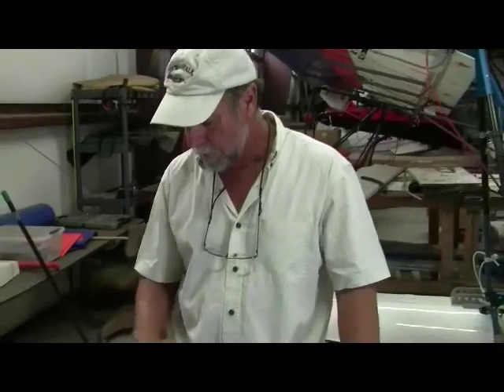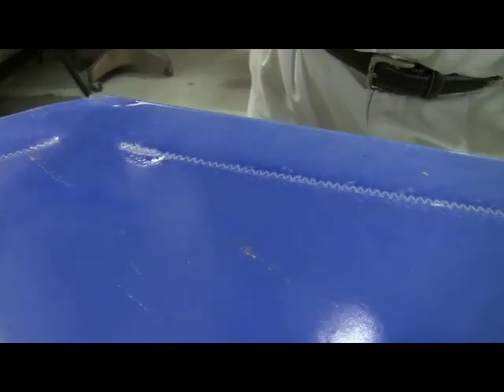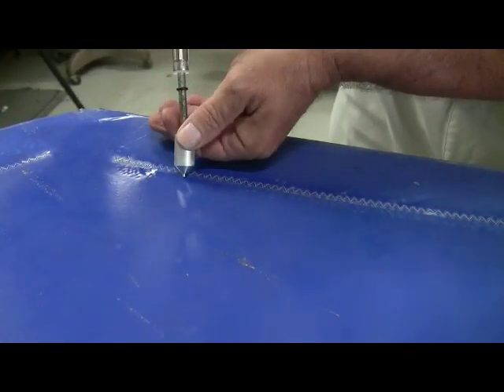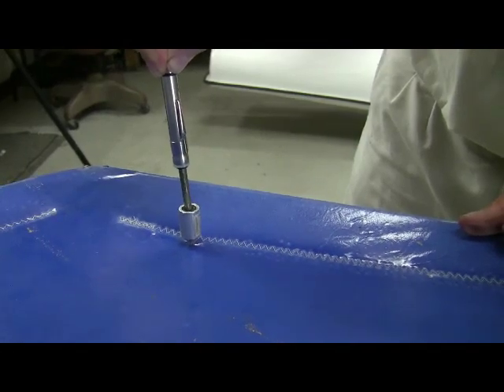The lower part of this rudder — when I tried it earlier, we found it was still serviceable. However, we have to have the whole rudder to fly, so I'll do a demonstration down here. We're going to go to 10 pounds, and you'll see it's not going to go through. I'm pushing right by the seam, going all the way to 10 pounds — and it didn't go through.